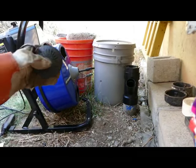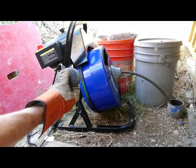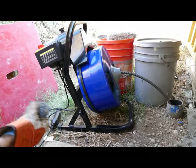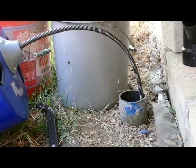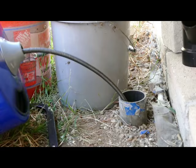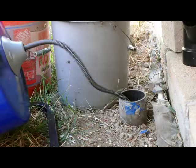The more snake you put down the drain, the more likely it's going to catch on things as you pull it back up. When that happens, you'll have to reverse the machine and may have to push it forward — just work things to get it unstuck. A drain snake with a power feeder has the advantage that it can push with force into the obstacle and grind it up. The problem is you can also damage the snake or the drain because you can't feel what's going on. Even with a power feeder, there's nothing stopping you from pulling and feeding the snake a little by hand to feel what's happening.